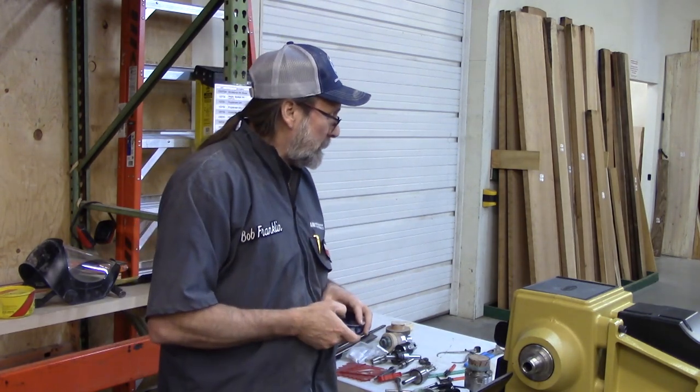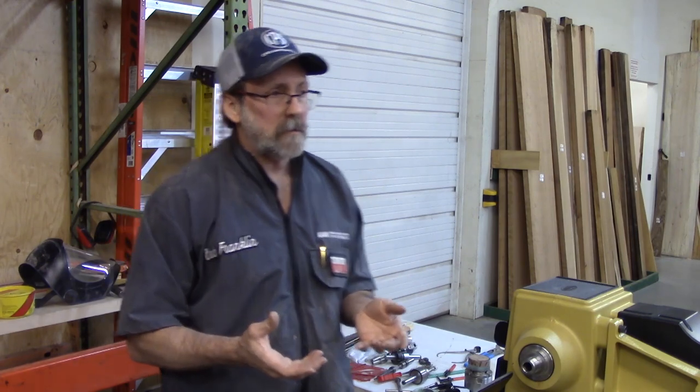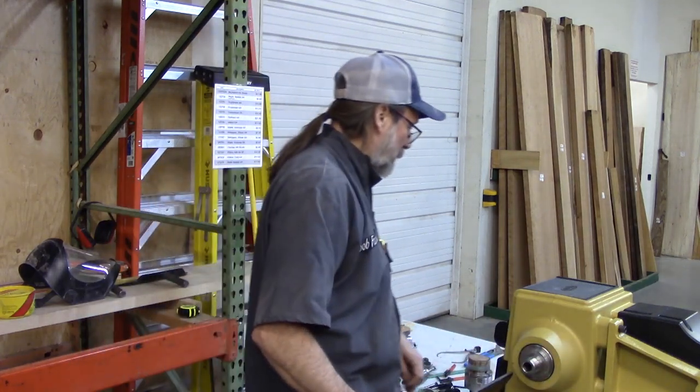Now, if I'm doing a straight wood blank or a straight stabilized wood, then I would probably not just polish it out. I would probably lean towards putting a finish on it. At that point, I would at the least do a friction polish, or go to the extent and do a CA finish on it. Be your choice if you want a more durable finish.